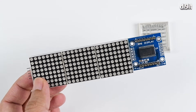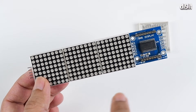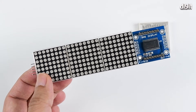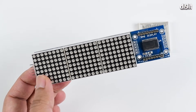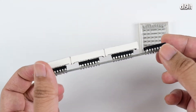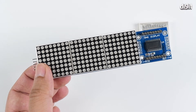For any of these applications, I would always suggest that you isolate the power supply separately. That way you don't have to worry about connecting four, five, six, or all eight modules — because eight is the standard configuration that most of these libraries support. So that's something you can easily run without making modifications of your own. That's it for the 8x8-bit FC16 dot matrix display in a one-by-four configuration.